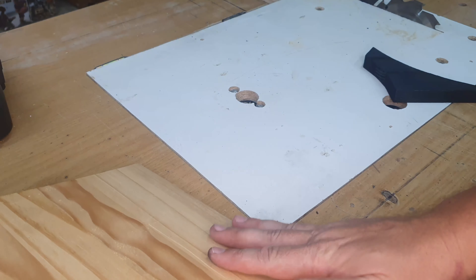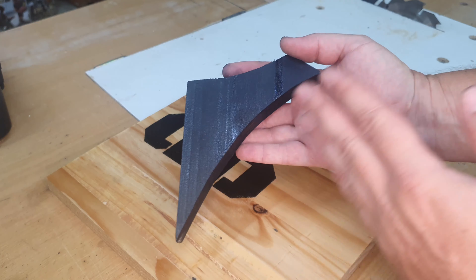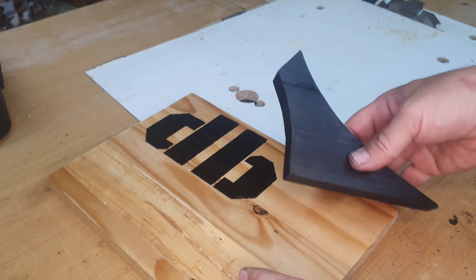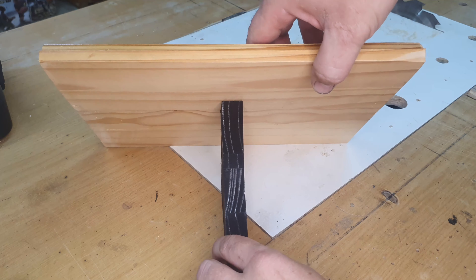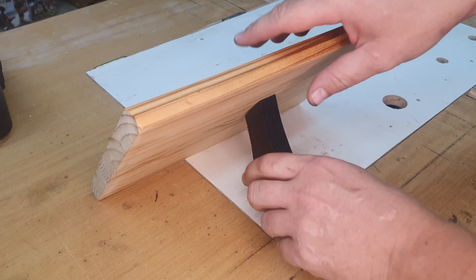For the foot piece at the back to keep this upright, I looked through my scrap wood pile and found some off-cuts. I cut an angle at one short edge so it can be used as my foot piece. I'll put it down like so, put the board up against it, and attach it with a screw from the back and some wood glue - less intrusive than from the front. A very useful purpose for a piece of off-cut wood.